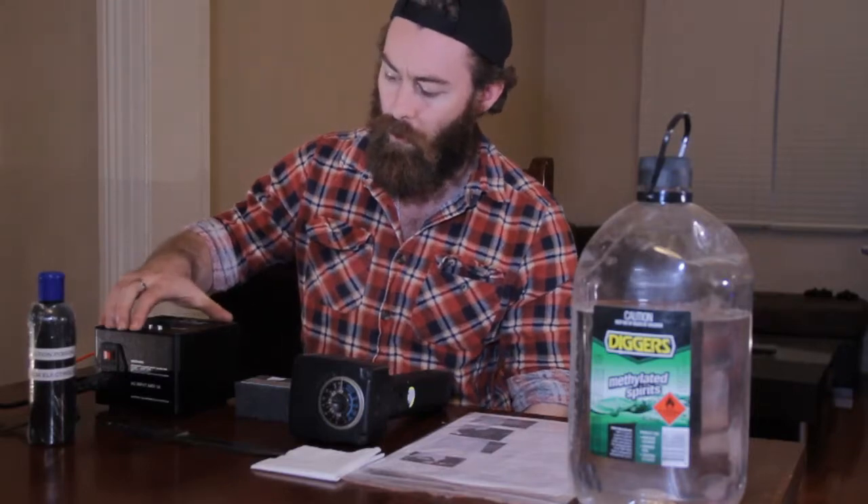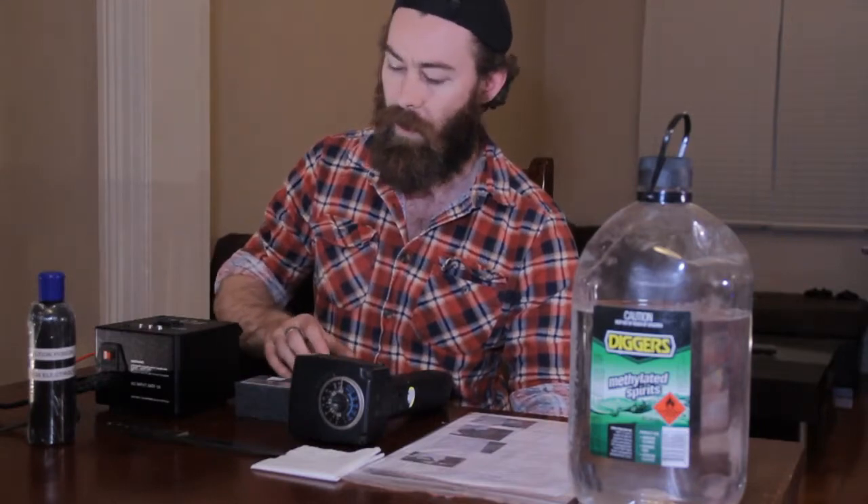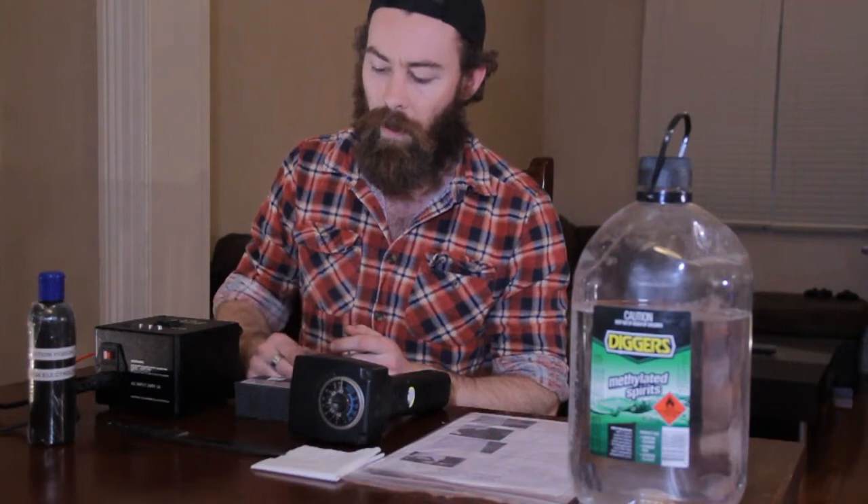The metal marker is a very versatile sort of a unit. You can use it in a few different types of ways to get an electronic etch into steel. You can use vinyl stencils, you can use nail polish and then cut your design into the nail polish. You could probably coat it in bitumen and get that laser engraved through so you could then zap it in.